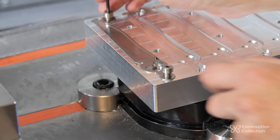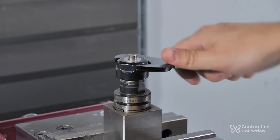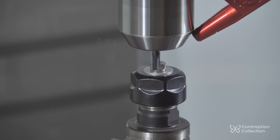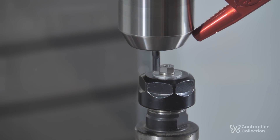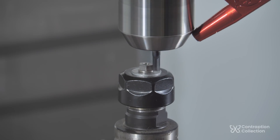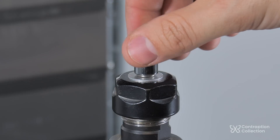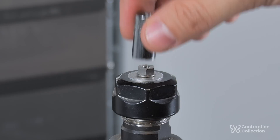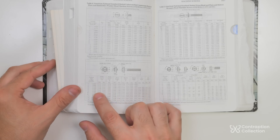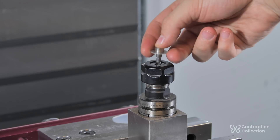I like these screws, but I hate that you have to use a small allen key with them. Let's try cutting a hex on the outside. That looks pretty good — socket fits. It seems a bit loose, but it's actually a few thou oversized and Machinery's Handbook just says to go to the fractional diameter. Maybe better quality sockets are tighter or something.